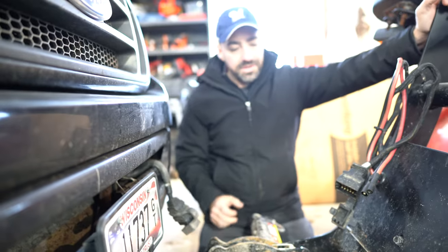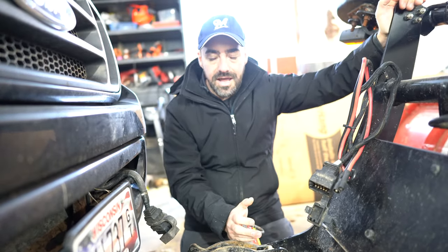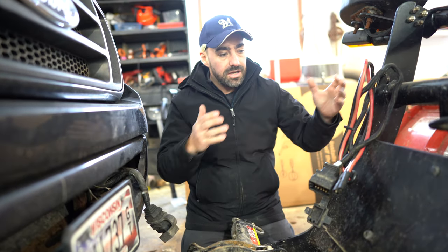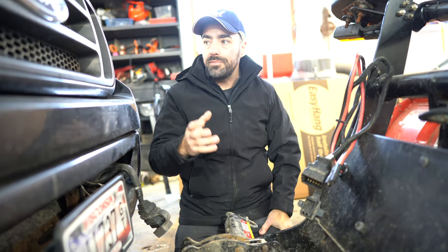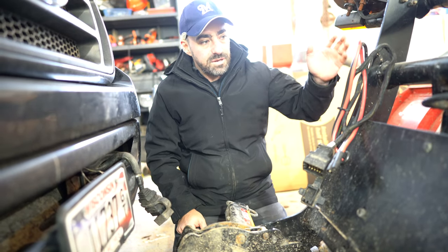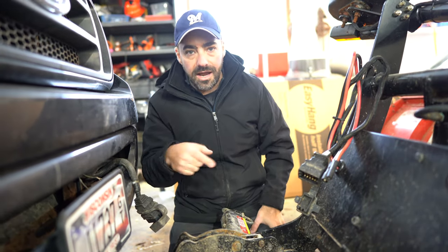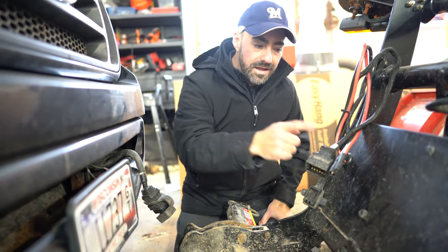The interesting thing with how hydraulics work is, I never understood this before, but on old plow trucks, they'd have a hydraulic pump, and the hydraulic pump pumps fluid that you can use in the cylinders. Well, on old trucks, that pump used to be mounted under the engine, and when you turn the engine on, it would turn that pump. I don't know how long this has been, but on my plow and most plows, they have an electric motor which turns a hydraulic pump. So you only need to provide electricity to this.